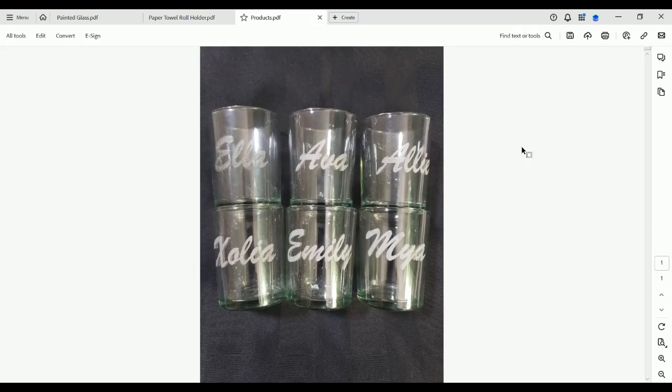One other thing I came across when researching glass preparation: a mixture of titanium dioxide powder and rubbing alcohol — three parts alcohol to one part titanium dioxide powder. If you make that solution and spray, brush, or roll it on, apparently you get a much smokier, almost black engraving on the glass. I haven't tried it yet, but I'm looking forward to it.